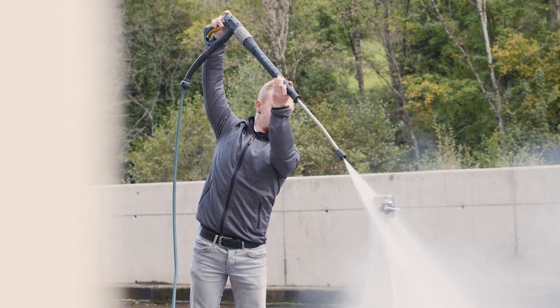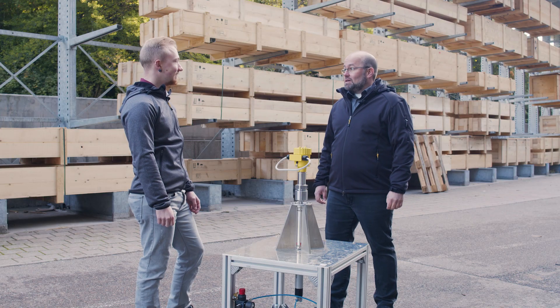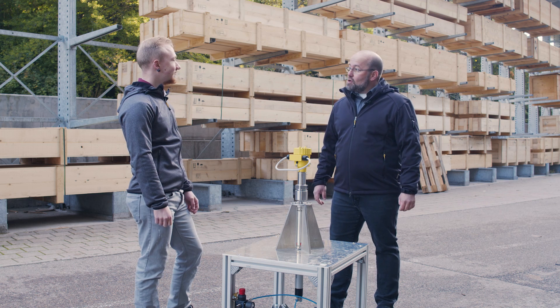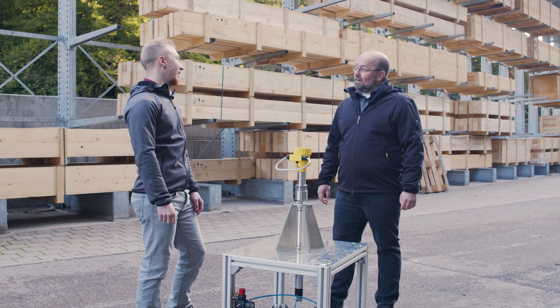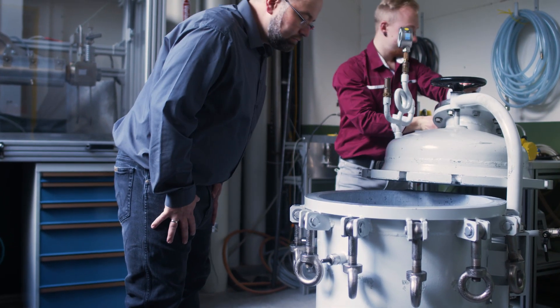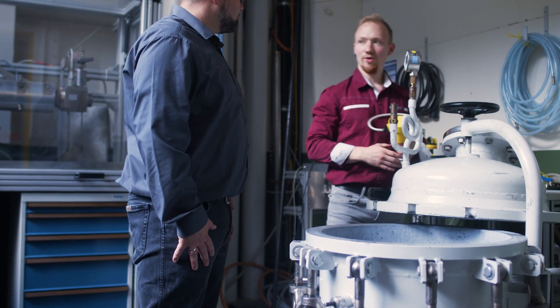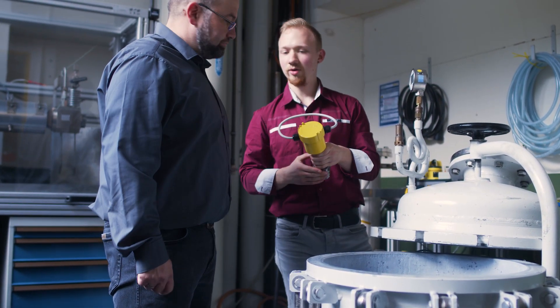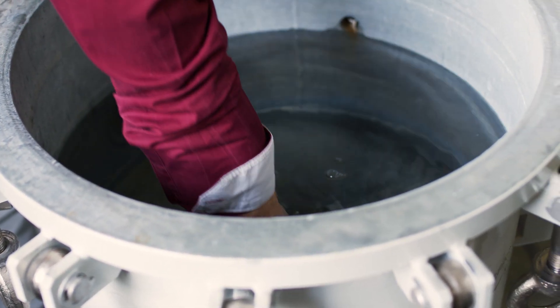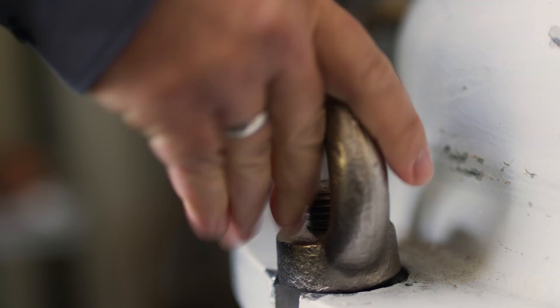The instruments are pretty tough. How do you ensure that the sensors survive temporary or permanent submersion? That works with the help of a pressure vessel. To test protection classes IP67 and 68, the sensors are submerged in water in this vessel. When the vessel is pressurized, no water may get inside the sensor for the duration of the test.